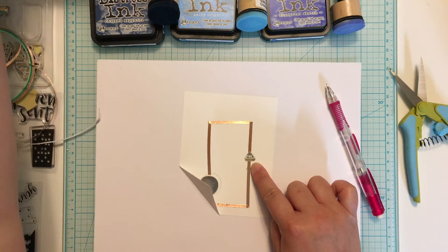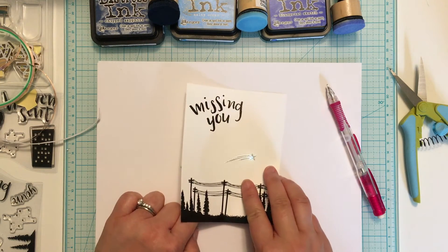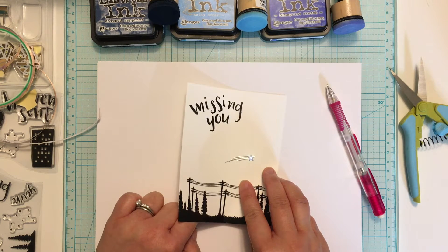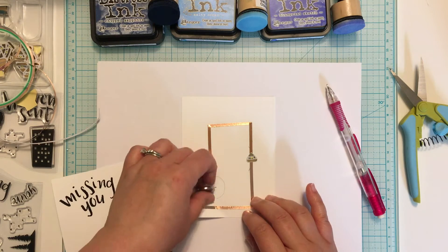The reason I cut my panel a little bit smaller is normally the light won't be exactly where the pencil dot was, since you can't see through the light. And this way I save myself some unnecessary trimming at the end of my project.